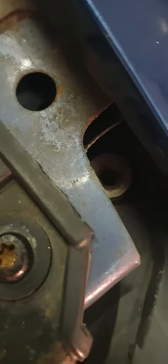Now we need to bring it up right onto the 0.5%. To do that, get the bonnet up. There are two adjustments in this vehicle: one here which takes a 6mm Allen key, and another one down here. This one controls the pitch, and this one brings it up and down ever so slightly.